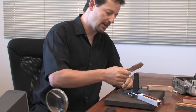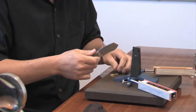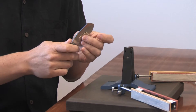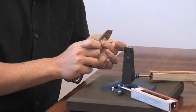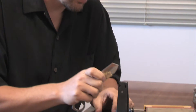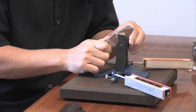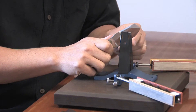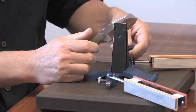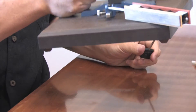I'm going to mount the knife in the clamp with the blade side down and the chisel side up. Because this side is sharp right here I don't want it to get scratched or dinged up on the inside of the clamp, so I'm just going to wrap it with a small square of chamois cloth and then slide it into the clamp edge down. I'll set it in until it drops, snug up the top with the key, then snug up the bottom even more firmly — the blade is now very firmly clamped.